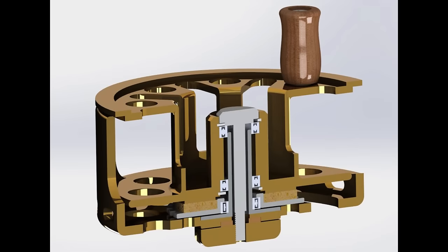The drawbar is more or less just a fancy stainless steel screw, but with a few custom features, like the ledge for the top spool bearing to ride on, and a flat surface to prevent it from spinning when the drag knob is turned.